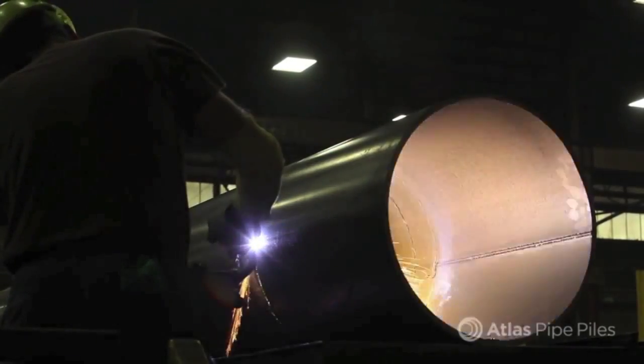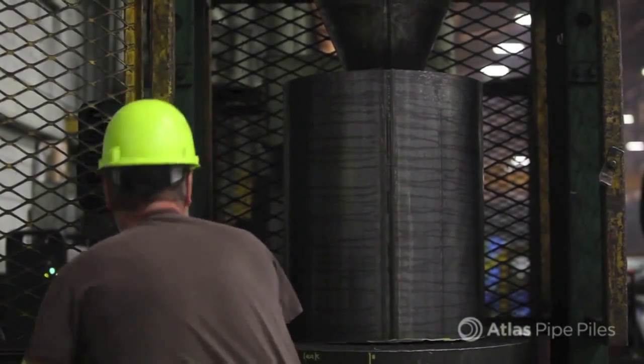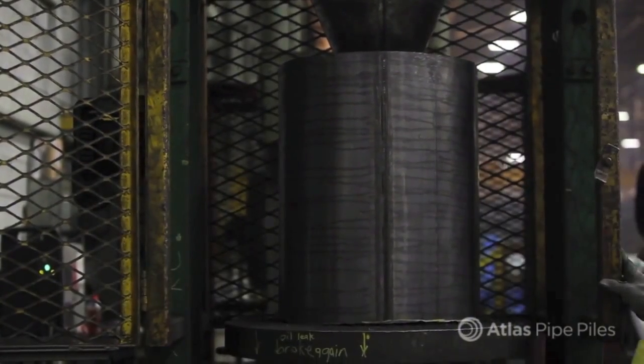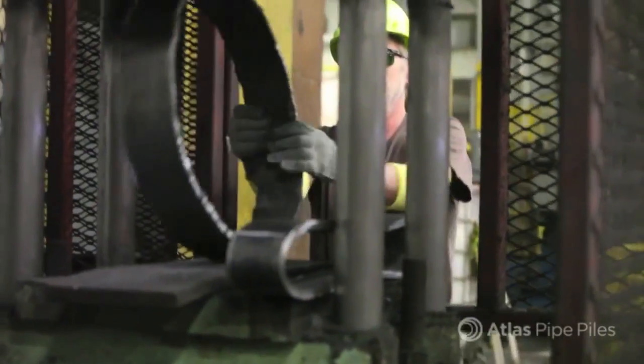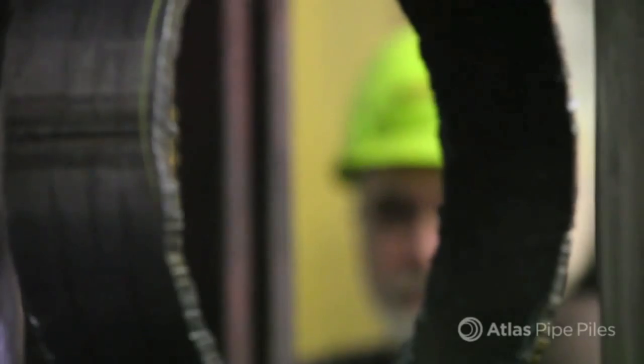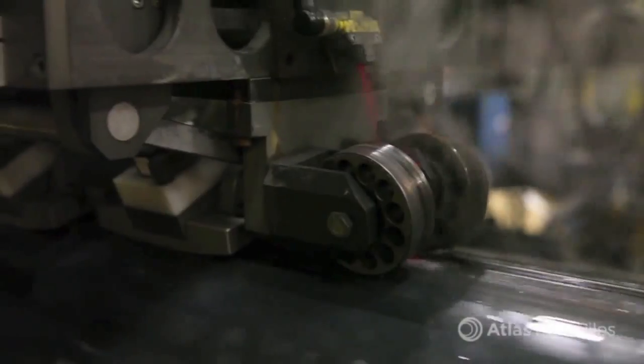Piles undergo two destructive tests. The cone test tests the integrity of the weld by forcing a hydraulic press until the test piece fails or is expanded to a predetermined amount, without failure of the ERW weld seam. Flatness testing involves flattening a sample with a weld at the vertical and horizontal axis, or 0 and 90 degrees to the direction of force. This test verifies weld integrity and the ductility of the steel welded seam.